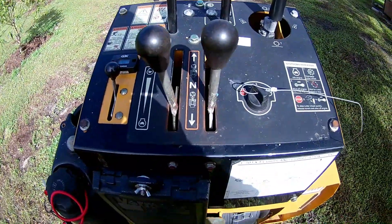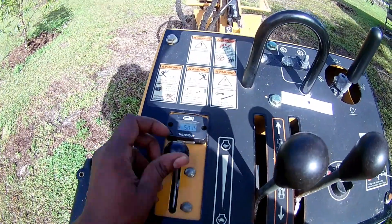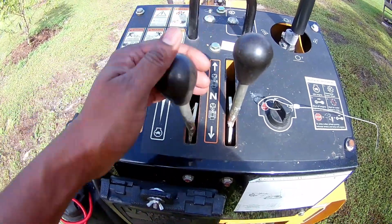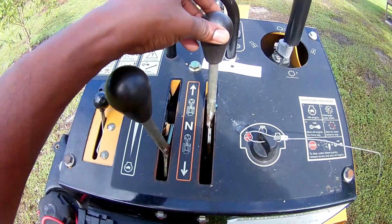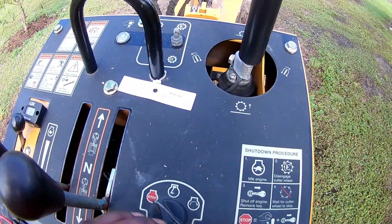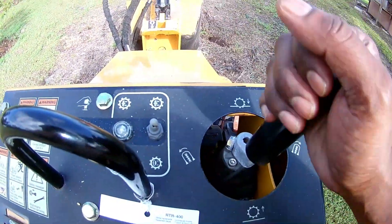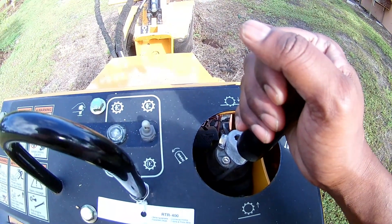On this particular grinder, you've got your controls: your throttle, fast and slow. You've got your forward, left wheel, neutral, reverse. Your right side: forward, neutral, reverse. Your start, stop, position C. And this is your joy stick — right here they call it the dead man's stick. Your hand has to be on this stick in order to activate the wheel.